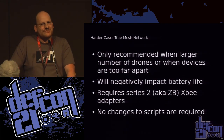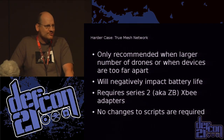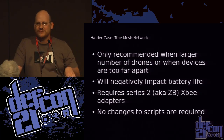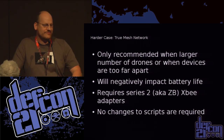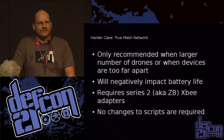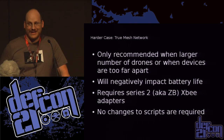If you really need true mesh networking, you can do it — and the nice thing is you don't have to change anything in your scripts. You can take out your series 1 modules, put in series 2 modules, and it's really just a matter of configuring them correctly before you plug them in. Something to keep in mind: if you set up a device as a router, routers are not allowed to go to sleep because routers that don't respond are bad.